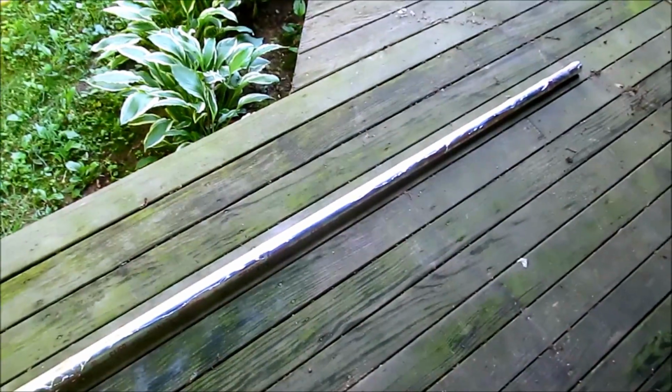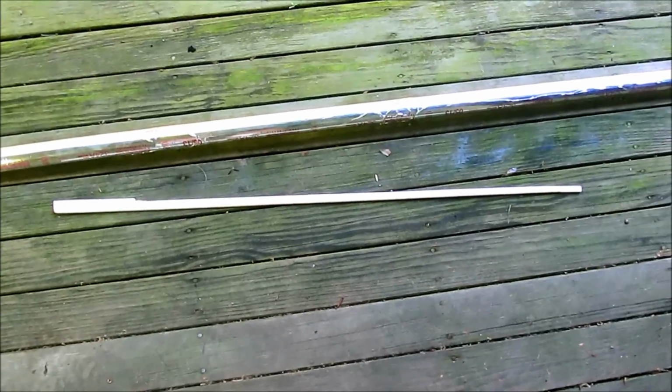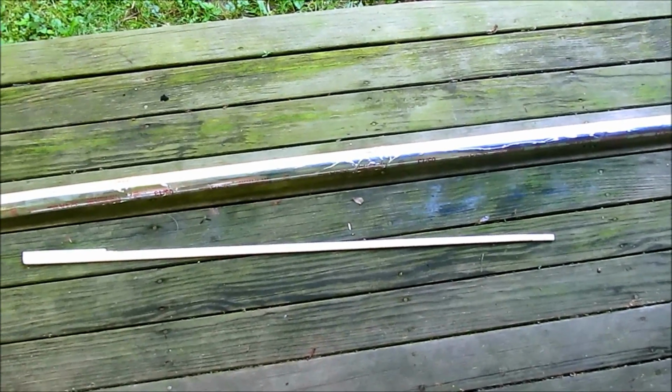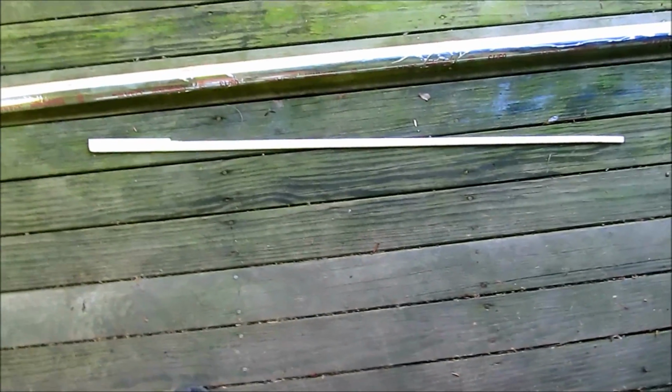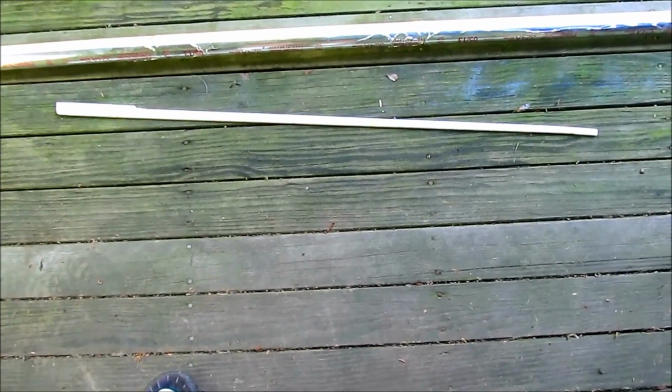Actually, I had a little bit of a forehead slap moment. I know, per the flat profile cutout of this spent rocket, where the center of pressure is. Dave Sleater details how to determine the center of pressure on a rocket like this where you're dealing with only round components. It's very simple to make a flat profile cutout in something very light, poster board or foam board, and determine where the center of pressure is simply by where that balances. I know that's up 61.5 inches from the bottom. That's where I want the spent rocket to balance.